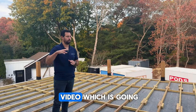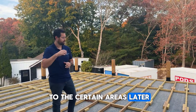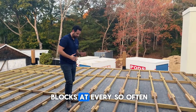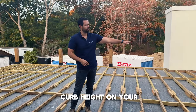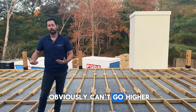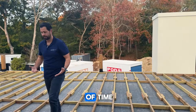We'll get into that in the next video, which is going to cover how we put the decking on and how to create some access to get to certain areas later. As you can see, we have blocks at every so often, and what you have to consider is your top of curb height on your roof deck — you obviously can't go higher than that. So when you're building your curbs around the outer edge of your roof deck and flat roof, you have to think about your decking ahead of time.